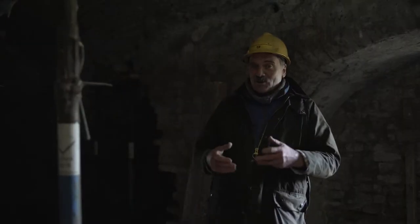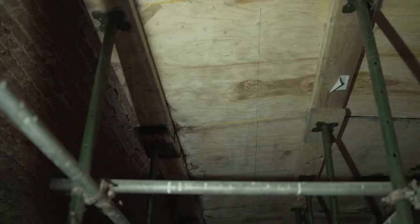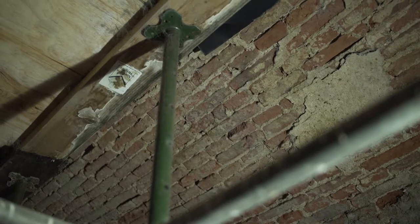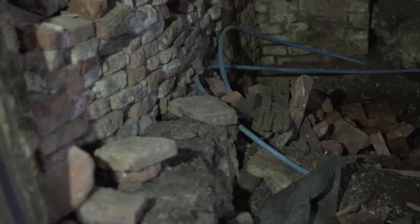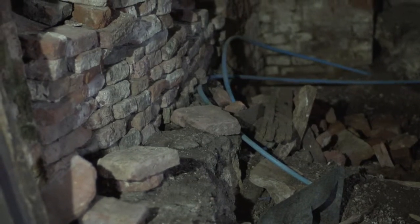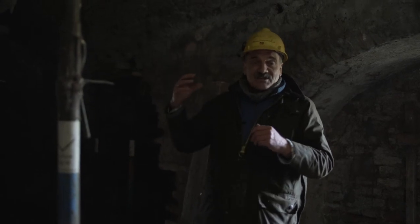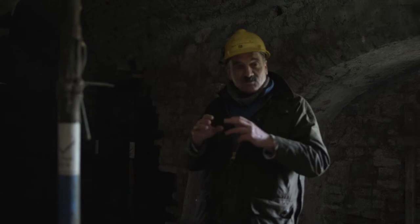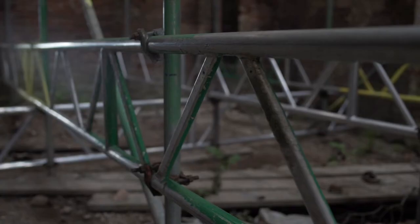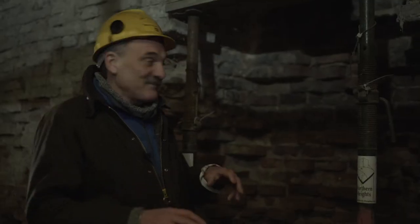We're down here in the basement — the ground floor. This was the key to the whole project going ahead. We put in this scaffold because this beautiful barrel vault ceiling was collapsing — bricks were falling out, and once one brick falls out, very quickly all the bricks fall out. So we put in this scaffold to hold it up. Above, when the contractors came in, they put their scaffold on top of this ceiling, but it's not really strong enough, and that was one of the problems we had with the scaffold — that's why we had to change and amend it.